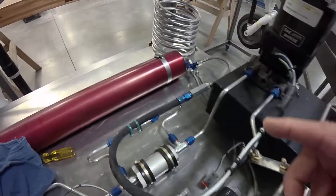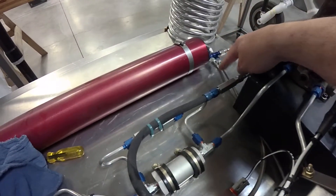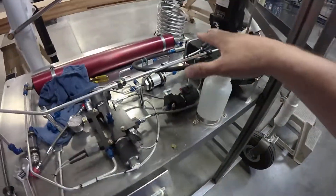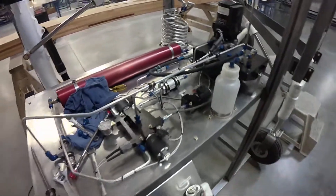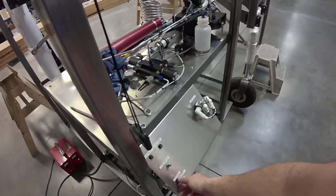Basically, this velocity valve — when pressure is between zero and fifty PSI — will bleed the pressure off the up side and let it go back into the reservoir. But as soon as it's hit with fifty PSI, it closes the valve and the gear can retract. So here we go — gear up, airspeed.